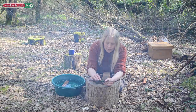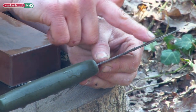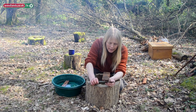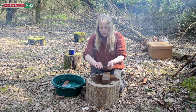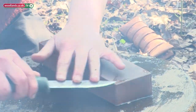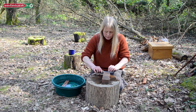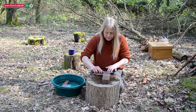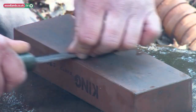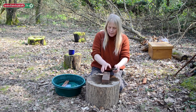It's quality more than quantity, so just get the actual action right. What you can do if you're starting out is colour the angle here along the blade - just fill it in with a felt tip. Then you know that it's being rubbed away. Once you've done the same amount, go on to the next stone.